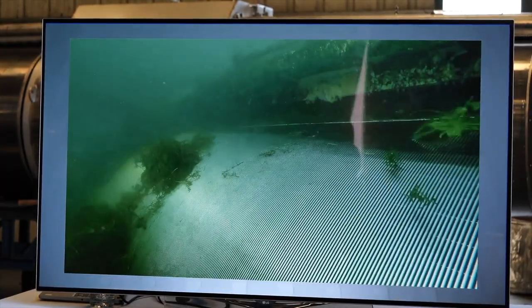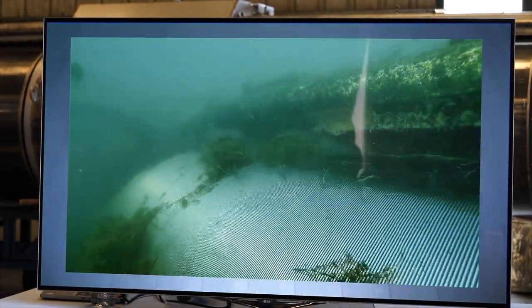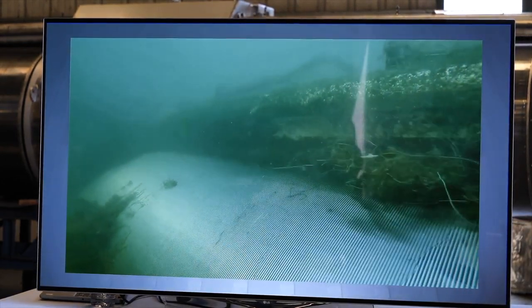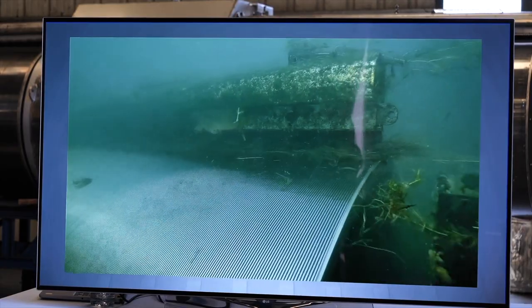I always say that we build all this stuff for cleaning, but really the easiest way to make a screen work really well is to make it too big. Just keep the velocities low.